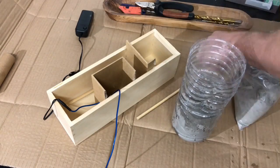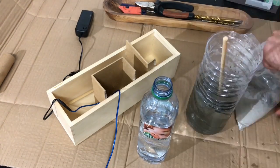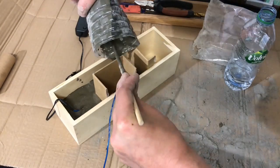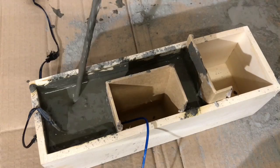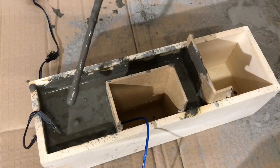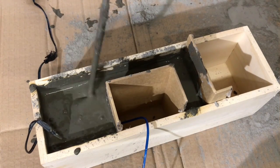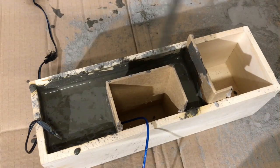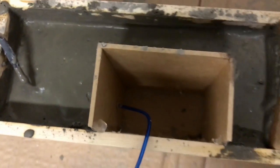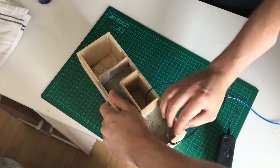On the box it says add 1 part water to every 3 parts powder. I just carefully added water to the mix until the cement became slightly pasty. Keep in mind that it's quickset cement, so when it starts to react it hardens fast. This stuff will set within 15 minutes. I decided to leave it overnight though to completely dry out.